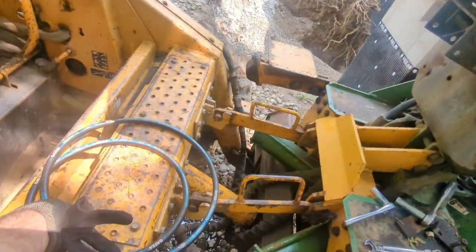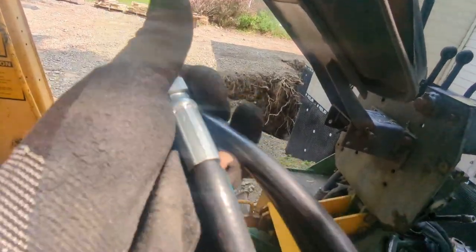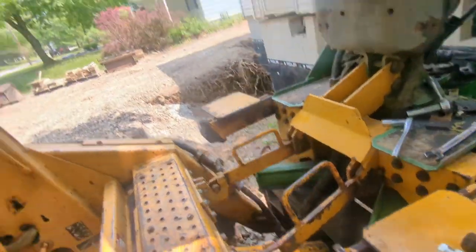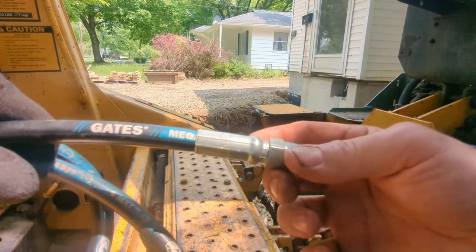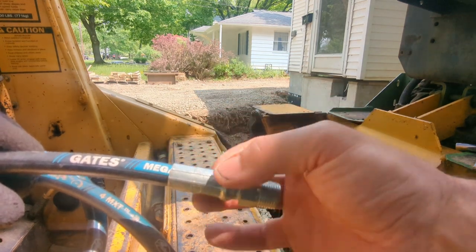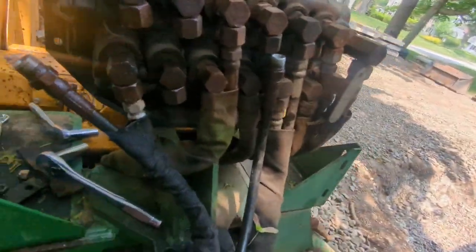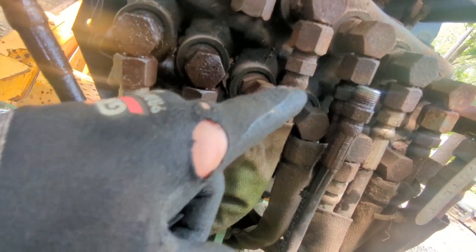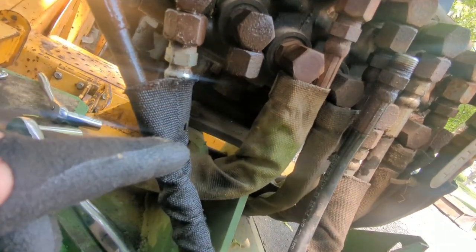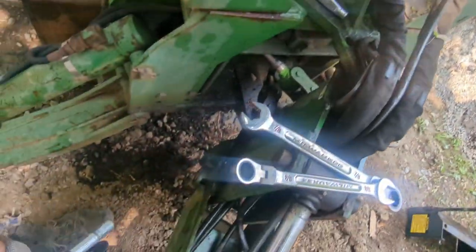There's all my fluid on the ground. Here's our new hose with this end. I forget the name of it every time, but this here is where, yep, it's where having two hands really comes in handy. So this here is where it's a smooth cylinder when you slide it over the hose, and then this physicality here is from it having been crimped on, which is what you need for this machine, because you come over here and all these nest, you know, the upper ones nest between the lower two connectors. You might get away with a Gates end on a lower hose, but I don't want to start messing with things here. This is the factory style that was on here. Essentially the same, which is what I keep doing here as I go. And it was a little over $100 for this hose